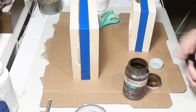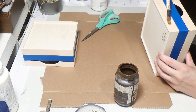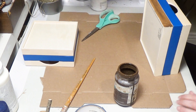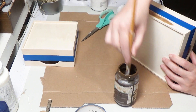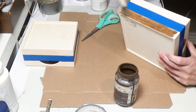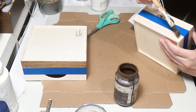Next I'm going to take the Waverly antique wax and use it as a stain. There's not much left in it but I'm adding a little more water just to reactivate it. I'm brushing on a nice light layer and then wiping it right off with a paper towel — I did not want a dark stain, more of a light walnut look. I'm only doing the bottom of the crate, not the top side.